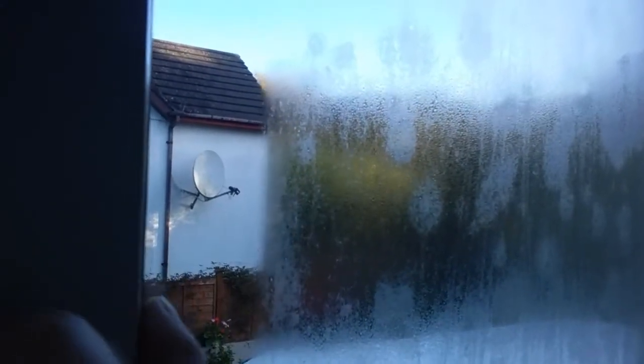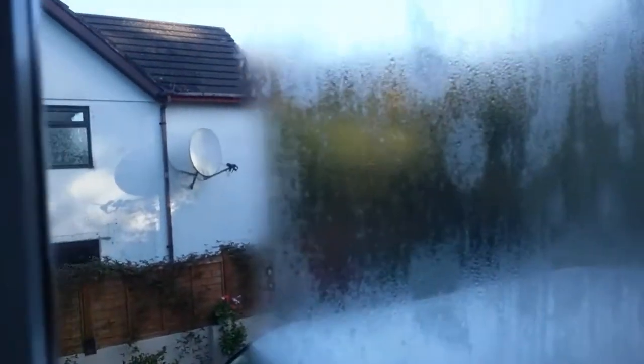You can see low-e glass, well insulated. You'd look at that and think there's condensation on the inside, but in actual fact it's on the outside. What you can see here is the heat has been transferred across from the frame into the silver joint there and gone across the glass, so that piece of glass on the outside is actually warm. But as it gets colder, the warm air hits that and condenses.